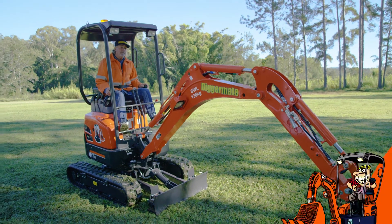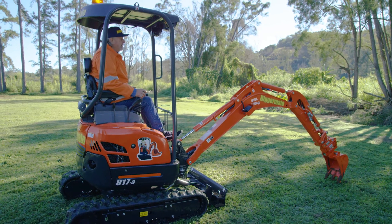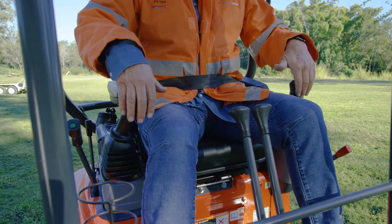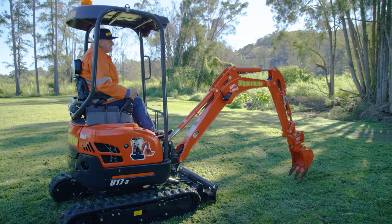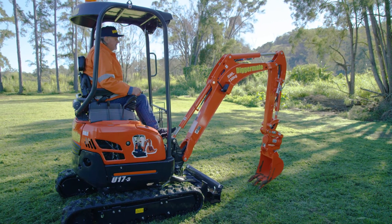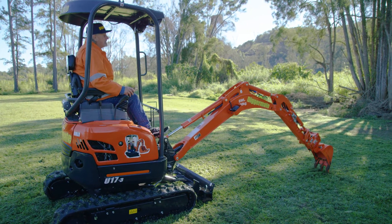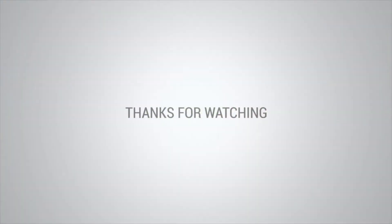Once you've got this, you've got the basics. When learning how to use the hydraulics properly, it's a good idea to use these two levers here — pulling through, getting a nice even flow all the way through. Try not to touch the ground; learn to get good control all the way in and then doing the same thing all the way back out. Once you've got control of that, you'll have no trouble learning how to actually use the machine properly for excavating a trench.